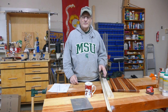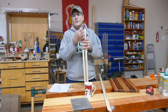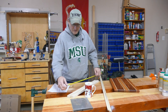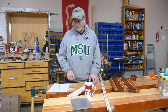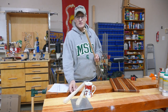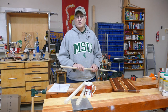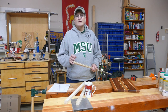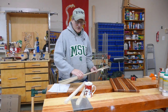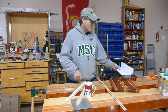What do I need for materials? All you're going to need is a couple pieces of like 18 to 20 inch long pieces of wood that are three-quarters thick by about one inch wide. I got two of those pieces here — these happen to be 24 inches. We're only going to use about 18 and a half inches out of these. And then you're going to need some dowels. I have these maple dowels — I'm using maple because it's a tight grain wood, absorbs water much, much less. In a wet environment, super easy to use these and not soak up a lot of water. I got three of these, 36 inches long, and we'll be cutting out 22 dowels. The materials are listed right here on the drawing. You can download that and check it out.